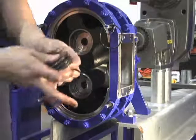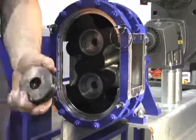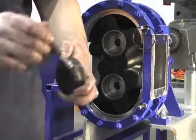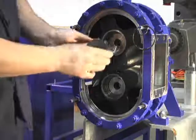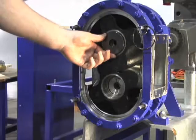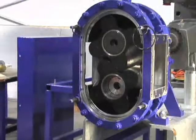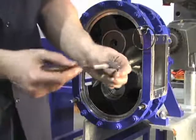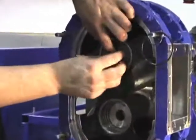Once the lobes have been fully seated, you will be able to take a pressure disc and place the larger O-ring on the outside slot and brush with gear oil. Insert the disc into the lobe cavity on top of the shaft. Then coat the smaller O-ring with gear oil as well and insert into the slot inside. Repeat this process with the other disc.